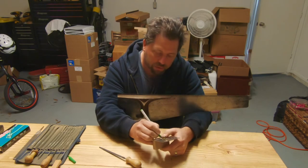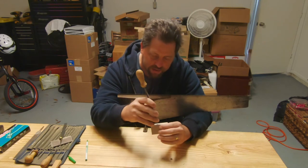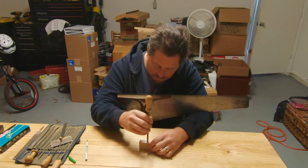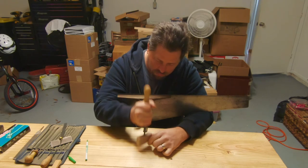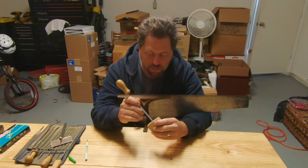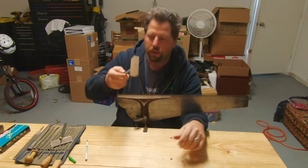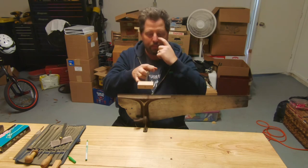I'm going to mark this right through one part of the hole. When I set this, I'll make sure that the flat of one side is right on that line. Now I've created a triangular hole — or at least some little nubs that will register the file each time I use it — and it'll hold the fleam angle at 14 degrees, provided that the block is flat.